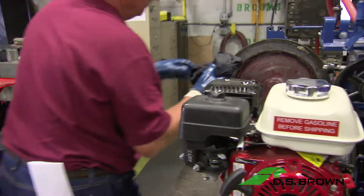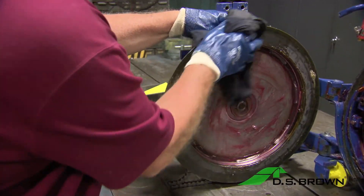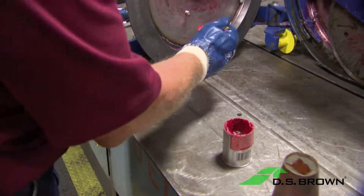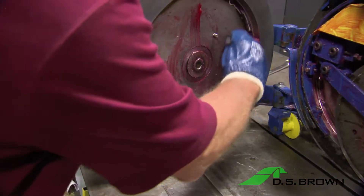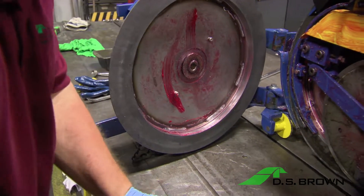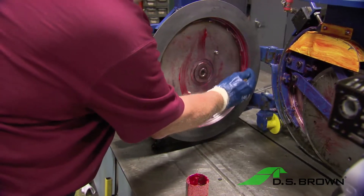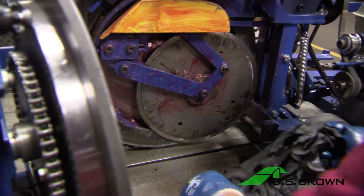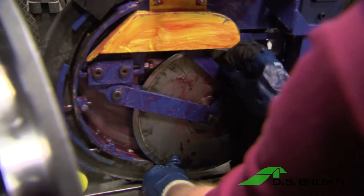Clean all the glue off the inner surface of the compression blade. After the compression blades have been cleaned, apply heavy-duty 90-weight grease to the inner surface, inner ledge, and inside outer face. Make sure not to get grease on the front face or the inner lip. The discharge blade must be cleaned each day after use — not doing so will freeze the blade and result in high seal stretch rates.